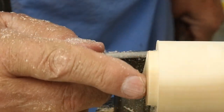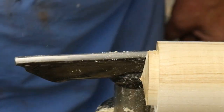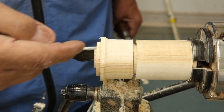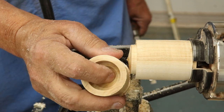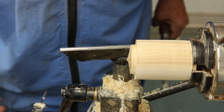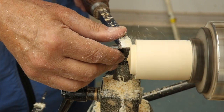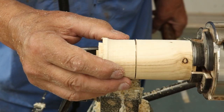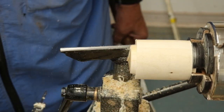I don't know if you can see it, but on that leading edge there's just a little bit of a burn mark. What I'm going for is a jam fit so I can put this on here and complete the top of the lid. So we're pretending — let's say this is sanded and finished, and I'm going to put this on here, jam it on, and finish the top of my lid. I'm going to put another taper on this — it's maybe two millimeters just on the front edge. It's just about there. Okay, I think I went a little bit too far.